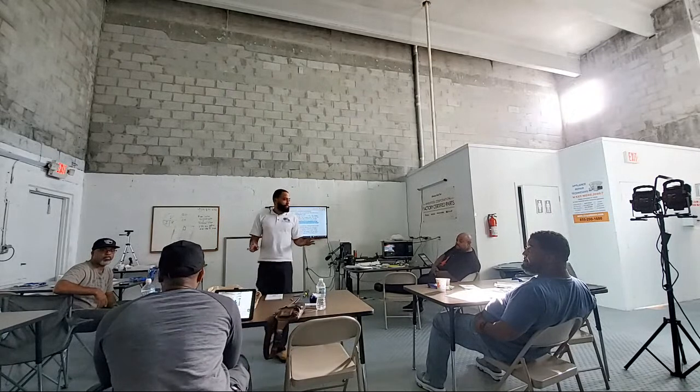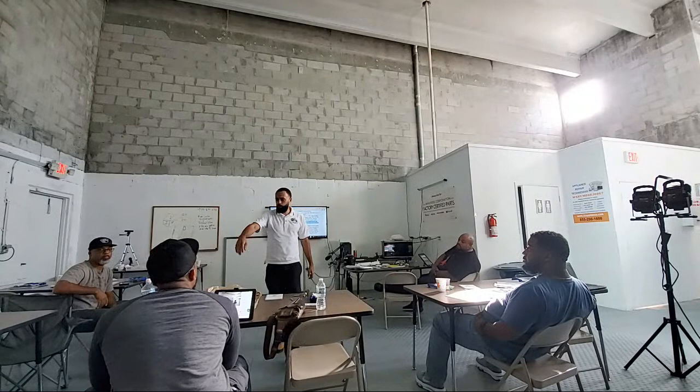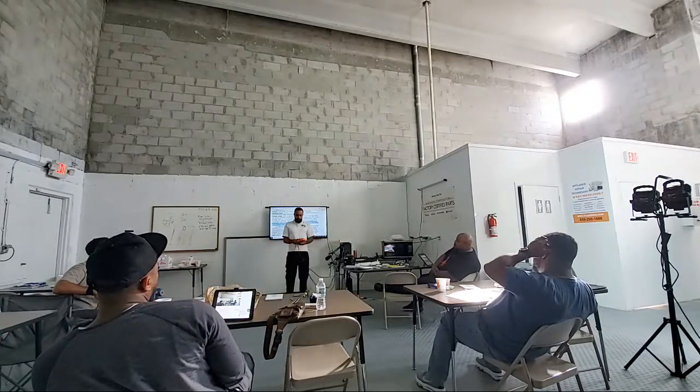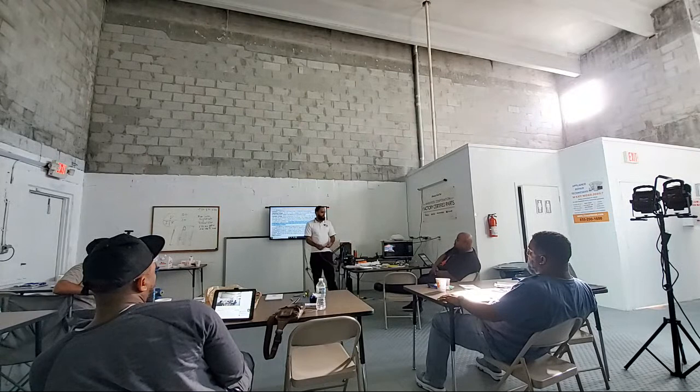Listen, anytime you're doing a continuity check, always test your leads. May I see that voltmeter? Here's Brother B. I like to give you my screw-ups so you know how I messed up. This is what Brother B would do: brand new rookie, have the lead partially inserted, and then take the test. Oh, I'm not getting any continuity. I'm no good, because look. So always make sure.